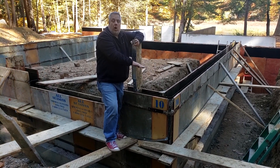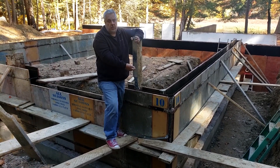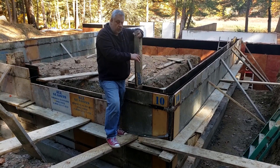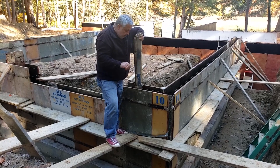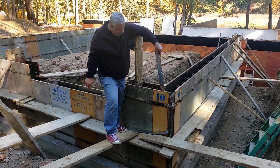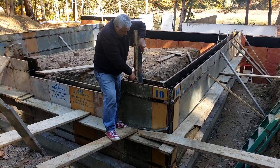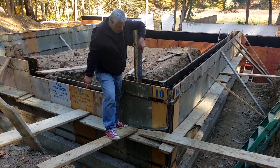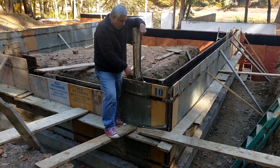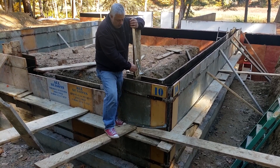When this wall wants to traverse left or right, this is what keeps that plate from ripping up off the foundation. The anchor bolts certainly assist, but this is in addition to the standard anchor bolts — we'll have a couple anchor bolts. Now, typically these get placed right here and there'll be a pair of them — one on the outside of the wall, one near the opening. One of the issues with putting them on the outside of the wall is you get a lot of spalling, and even bending it in, you're not getting a whole lot of concrete coverage in that plane.